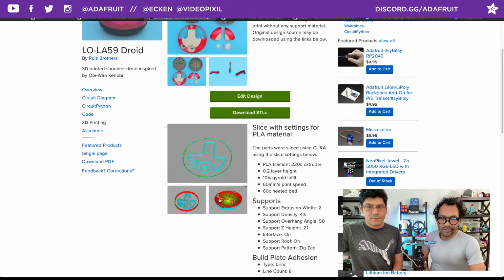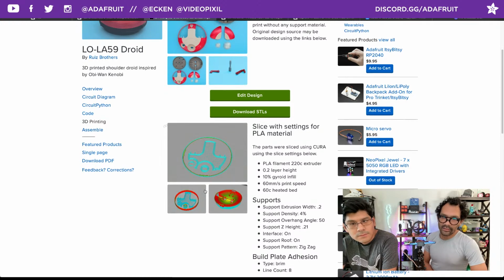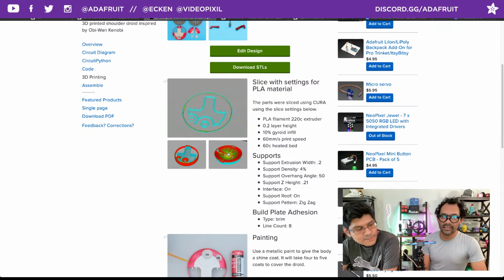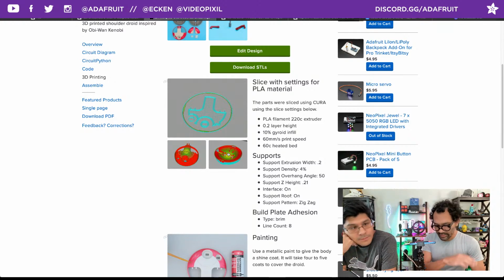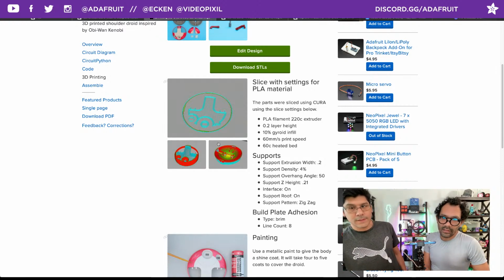Yeah. So for the layer height, I forgot to put one setting on there. It's the adaptive layer. Oh, cool! That's a new feature. Nah, it's not too new. Okay. It just adds more layers where it's doing the curves, it'll add more layer height to it. Cool. All right.